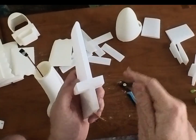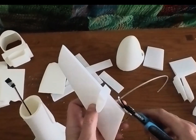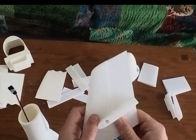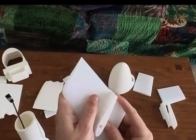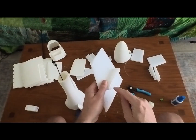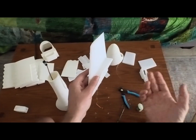All the parts, when I list the files, will have these little holes. You can slide in some filament, cut it, and connect the parts like this — that allows you to line the parts up without almost any extra effort. There are also alignment holes here. If you'd like, on the horizontal stabilizer you can add a carbon rod. Not necessary, but it helps increase durability and strength — like when you land and hit the ground, it might keep the part from breaking.